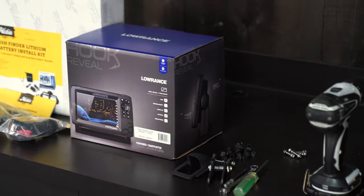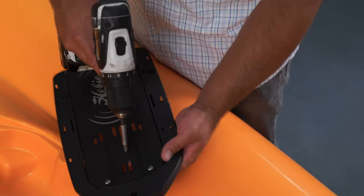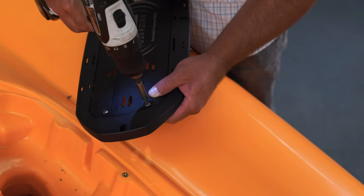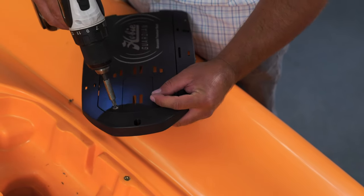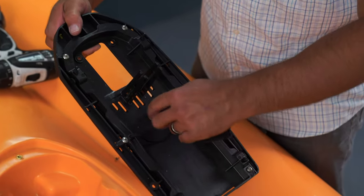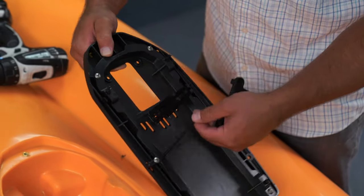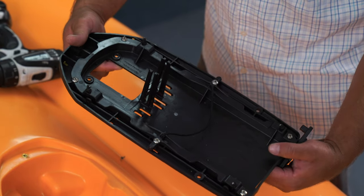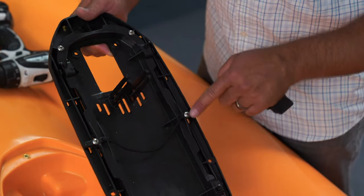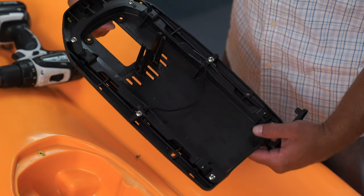So just those three screws there, unthread those. Next step, we're gonna pop this through plate out because we're gonna install the scooped plate for the side scan transducer. And then later on down the line, we're gonna remove these six screws around the plate. That'll allow the suspension feature to be activated from the cockpit and allow the bungee feature to work. These are holding the plate fixed. You'd keep those in for a downscan transducer install, like if you were installing a bullet or a split shot.